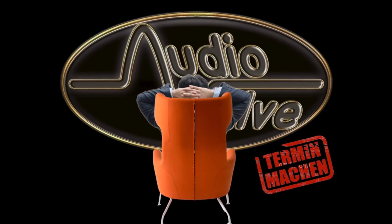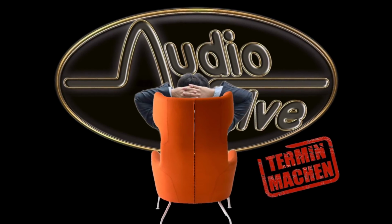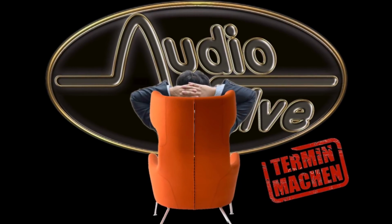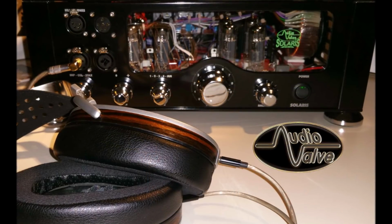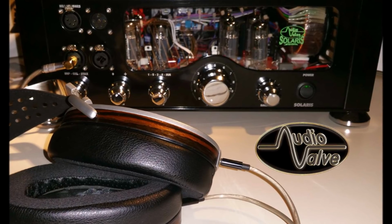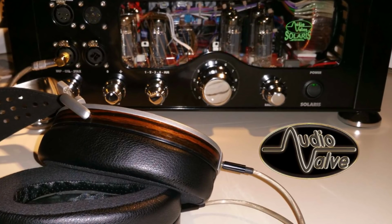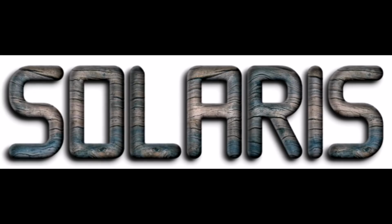In addition, there are the regular analog inputs for line signals. Input 1 and 2 each share a pair of XLR and RCA jacks, of which only one pair per channel may be used. In addition, inputs 3 and 4 come as unbalanced inputs. Directly next to it, the Solaris also receives signals from a turntable pickup on the phono input. Another pair of cinch passes a line signal to a recording device, and the preamp output can be tapped on a balanced XLR pair and thus drive a power amplifier. Even high-impact loudspeakers can be driven directly from the Solaris, because appropriate loudspeaker terminals are also present.